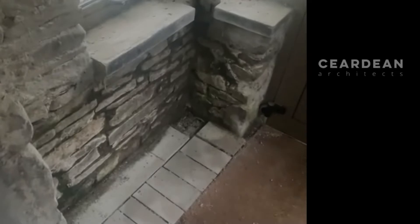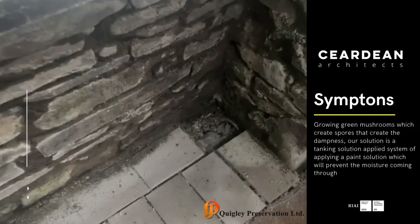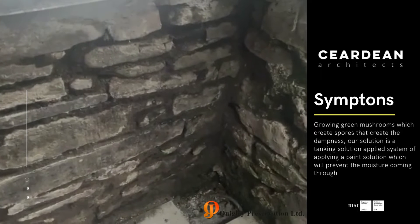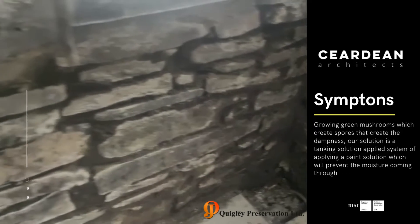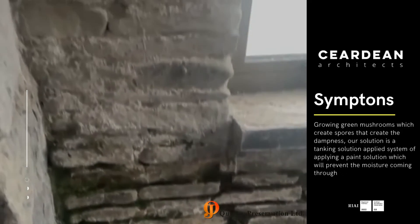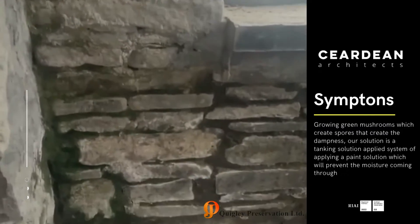So it's a real bane, it's a difficult thing to solve in cottages, and today I'm going to show you a number of solutions and the one that I chose, the problems that I had when I did it, and what I've learned along the way. This is some rising damp and as you can see it's very pronounced at the bottom of the wall, and as it moves up through the wall you can see it gets drier and disappears — that's the classic sign of rising damp.